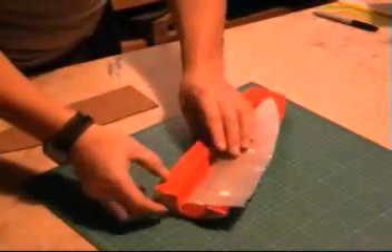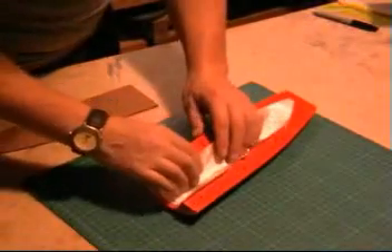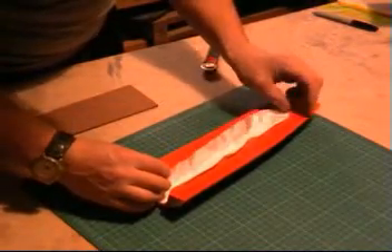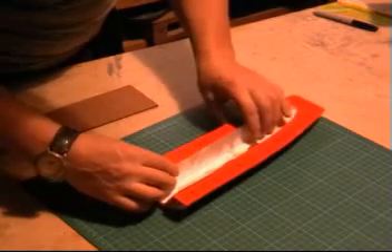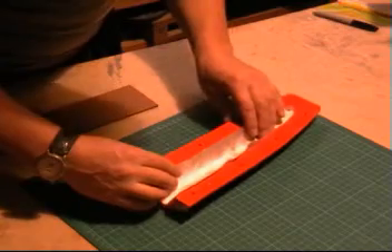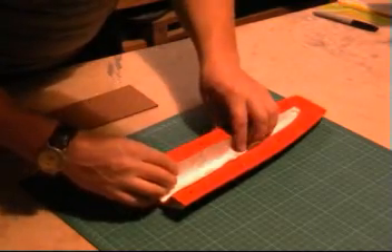The only other thing you have to do is wax up the mould. I usually put 10 coats of wax on there, and then coat with PVA — put it on with a sponge. And we're ready to start building a piece to come out of a mould.